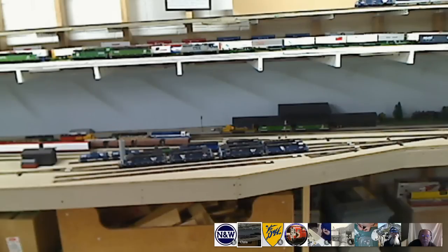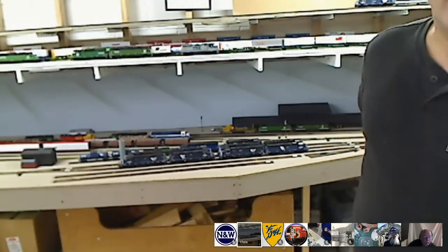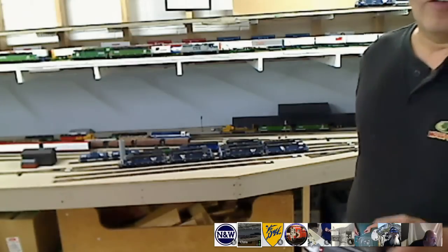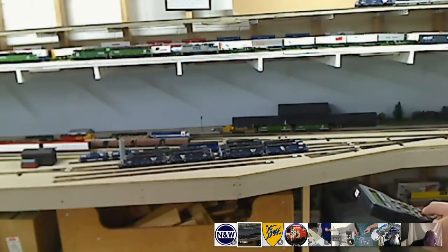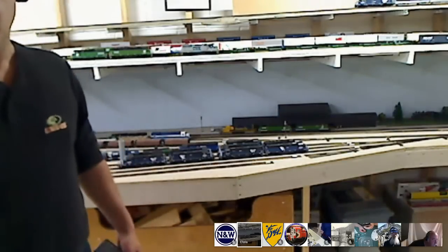Well, the first thing to do is just buy one of those speedometers. There's a simple way you can do it, but it's extremely time consuming. JMRI supports it, but it's tricky. Well, you can do what's called eyeball speed matching. You can take one locomotive that you like the way it runs, and you call that your golden locomotive. Then using a combination of CV2, which is your start voltage, or your lowest speed, basically where the locomotive will start to move, CV6, which is your midpoint voltage, and CV5, which is your maximum voltage.